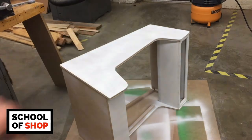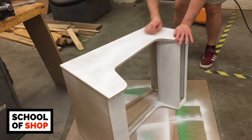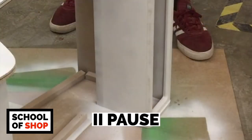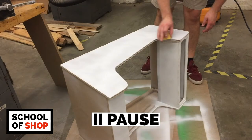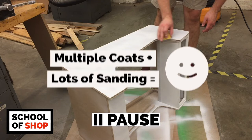Here's a quick painting tip: make sure you use a high grit sanding block between each coat for the best possible finish. Any cut edge like the 45 degree chamfers on the marquee and monitor frame just drinks up most of the paint sprayed on there, and I still don't know the best way to avoid that. My best luck has been to spend a lot of time sanding those edges really smooth before painting, and to do at least three coats of primer with sanding between each coat on those rough edges.